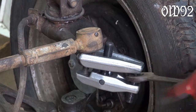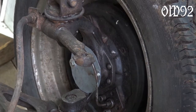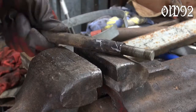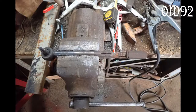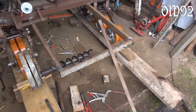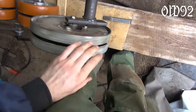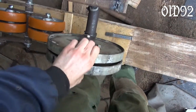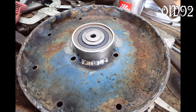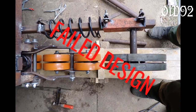After the spring was done I shortened both of the steering shafts to match the steering gearbox. Next step would have been to construct those wheels on which the track would run around — one wheel that drives the track, while the second wheel does the tension work. I couldn't find or make a proper solution for building those wheels and that tension setup.